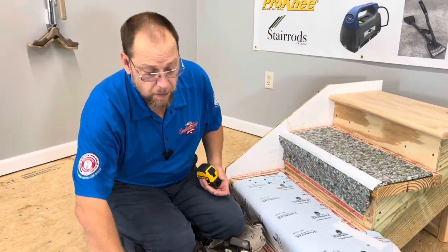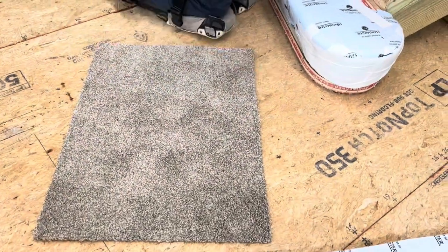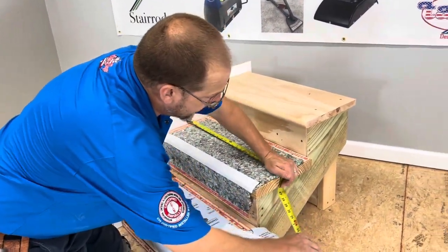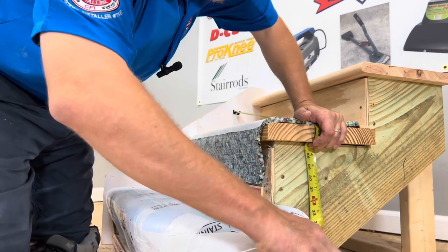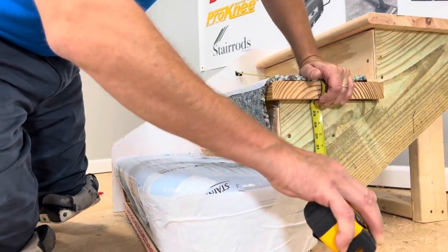For the size of the carpet — how I got my size for it — I'm going to take and measure all the way from my wall, hold this here and push down under the edge of the lip. You can see it's about 27 inches. I give myself a couple inches, so I actually cut this piece at 29 inches.